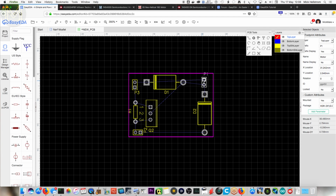If I want a piece of copper track on the other side of this board, logically I'm looking at the top of the board with my components, and on the other side are my copper tracks. Or you can have the copper on this side as well. Oh yeah, I suppose you could. There's actually no difference in pricing from JLC. So when you say two layer, you mean the copper's on both sides of the board. Here's the thing though, I need space for those tracks. Like this big hole here, I can't have a track going too close to the holes. Correct. So what you could do is shift that diode down a bit. Yep. Oh yeah, okay.